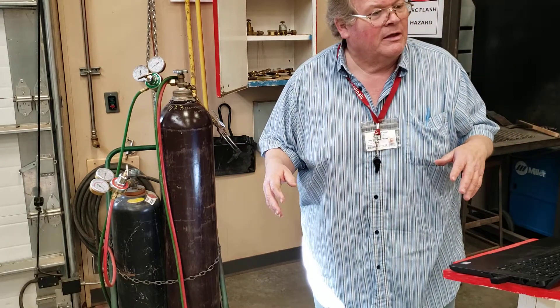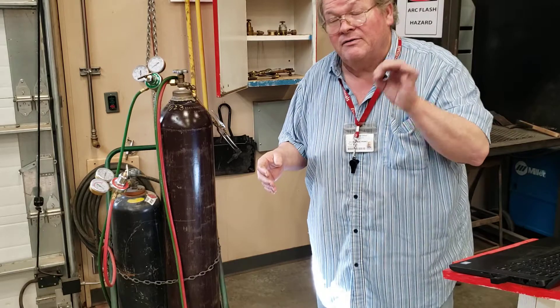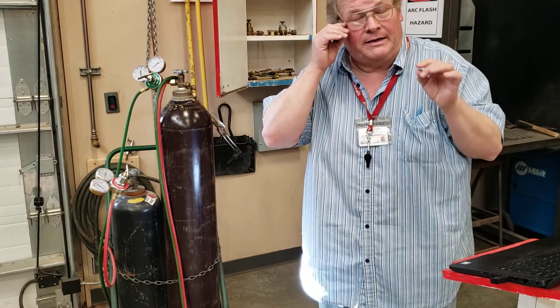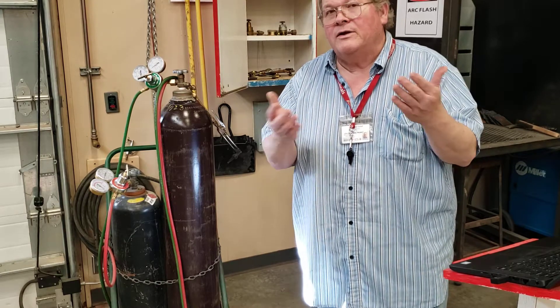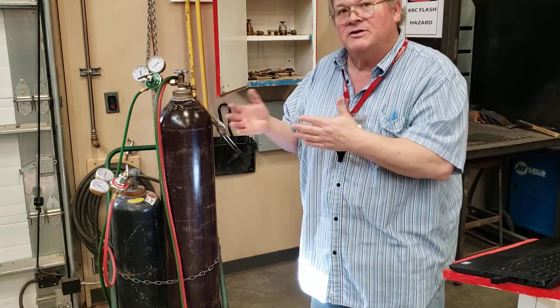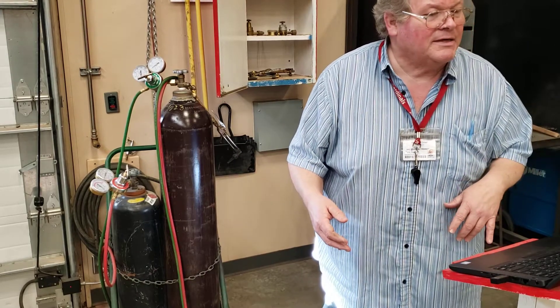Question 16: an oxygen-acetylene flame produces heat — Miller Open Book tells you specifically 5,589 degrees Fahrenheit. Most textbooks say somewhere around 6,000 or 5,500 to 6,500 — I want the Miller Open Book answer. Number 17: oxy-acetylene welding can join dissimilar metals. Depending on the welding process we can solder carbon steel and stainless steel together, we can braze copper to a metal fitting. It's not just one type of metal, but it depends on the welding process — is it solder, is it brazing, is it filler rod?